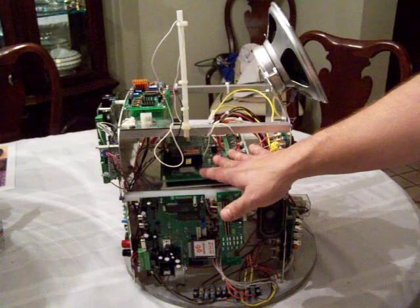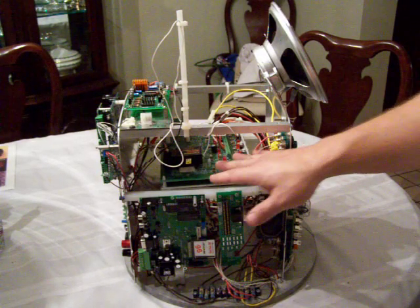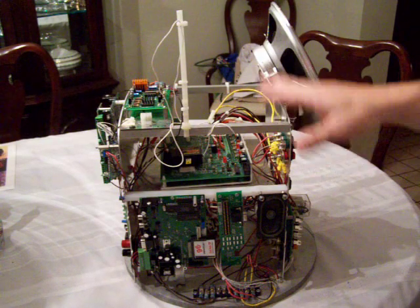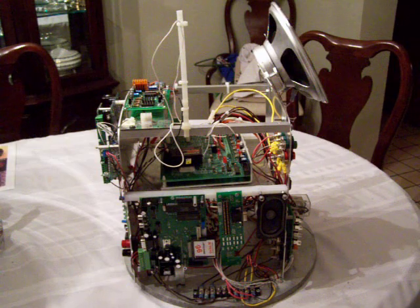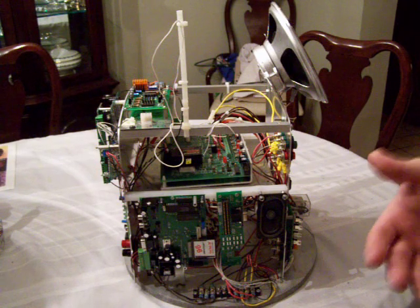The board up here is my main power system that I use to run everything. Its job is to take the 24 volts main fused power to this board. On this board I have individual regulators that take the 24 volts in and give me regulated voltages fixed at 12 volts, minus 12, plus and minus 5 volts.